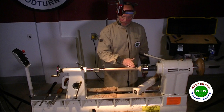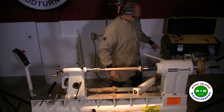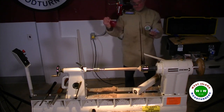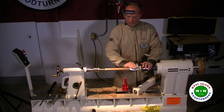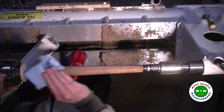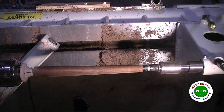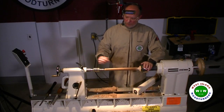Okay, and each one same thing, forward, reverse, with the grain, forward, reverse, with the grain. And then the last step would actually be, at the 240, a water bottle, strip, I'll wipe it down to raise the grain, okay? And I'll do that only at the 240 step. If you do that before, I think you're basically wasting your time. So I'll do that only in the final step just to make sure that raise the grain, then I'll go through the 240 forward, reverse with the grain.